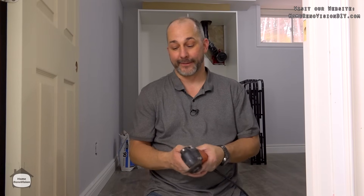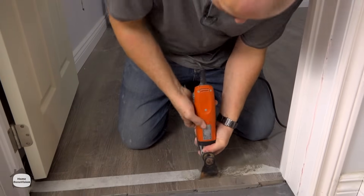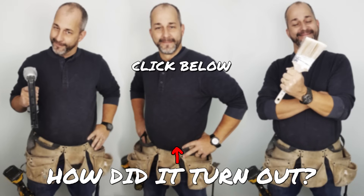We've now shown you all the different techniques you'll need to successfully install these trims. Remember it can drive you nuts, and if all else fails you can use construction adhesive and paint cans and tape — but if you don't need to, the track system performs really well long-term. Using adhesive glues the floor together and you lose the ability for expansion and contraction. Don't forget to subscribe and like the video, and we'll see you next time.